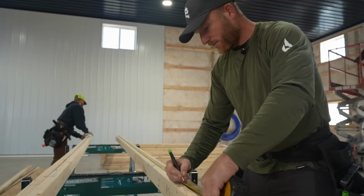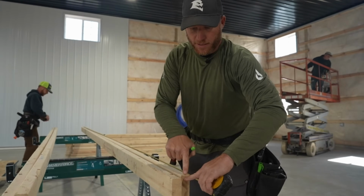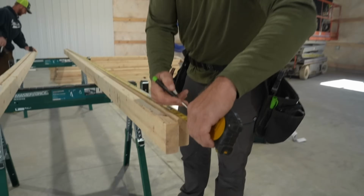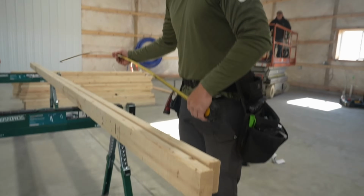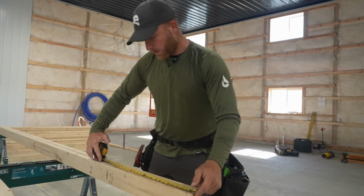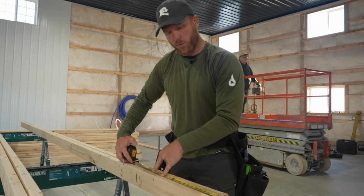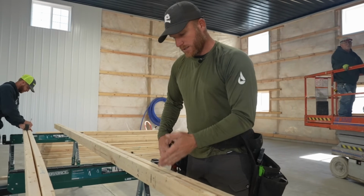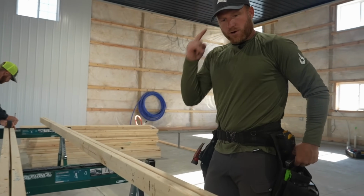Because we've got that messed up concrete wall over there, this will go up against the concrete, and then we've got an additional 1 3/8" that goes to the wall. So our weird bay just gets burnt up on this end. And that way also, because this is where our wall is, this is my 16 center, this is where our first I-joist will also go. So when we do our flooring, it'll be pulled right off the floor, 16 center for our subfloor and everything.